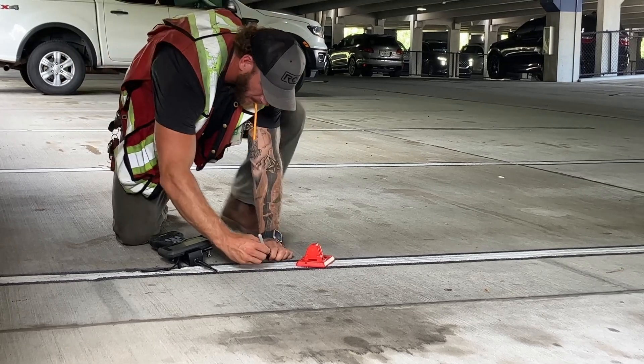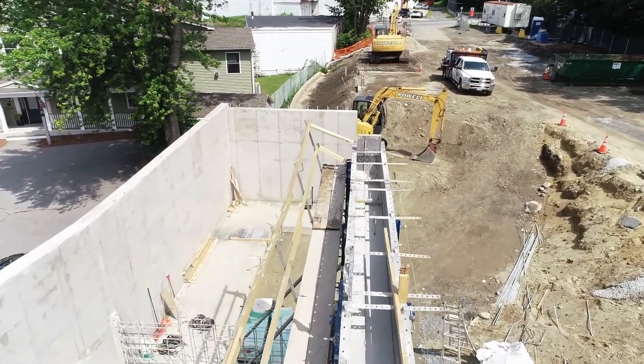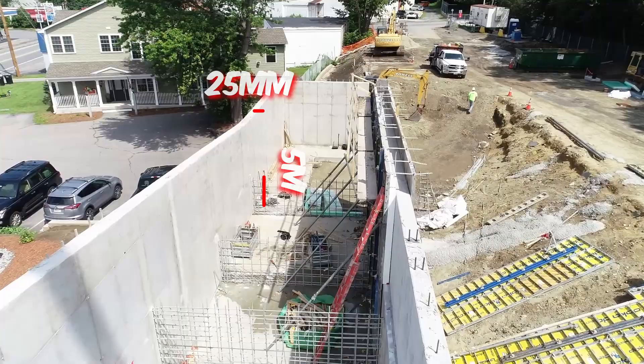When I've used it before I've had the question: how can you be sure it's plumb? Aren't you going to be adding pole plumbness error if the wall or ground isn't level or plumb? Well let's investigate that with a bit of math. A really poorly constructed vertical concrete wall will be about 25mm over 5m. If that were the case it would introduce a quarter of a single millimeter of vertical error given that we have a tilting height of 50mm — completely negligible. And in my experience doing quite a few floor flatness surveys, it's really a non-issue in the vast majority of slabs out there.